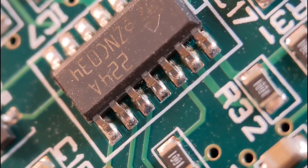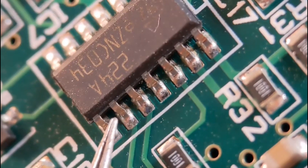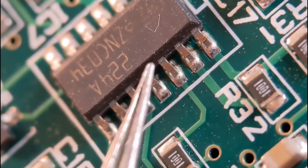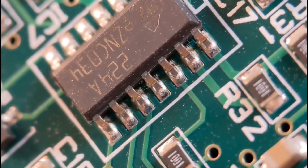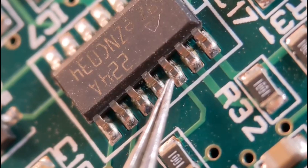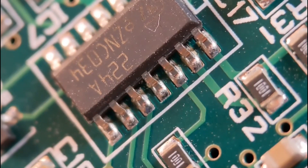Welcome to my latest video. I'm going to show you a few modifications you can do to your ICs to correct signal problems. I'll lift up pins and swap two traces going to the wrong pins, lift a pin on another IC and put a resistor between pad and pin, show wiring across the top of ICs, and show how to cut a trace going into a pin to disable the pad from the wire underneath.